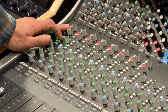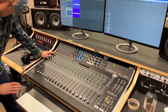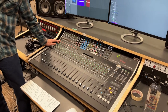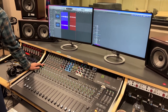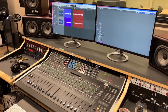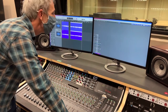It's a little buzzy but I think that's just single coils on that bass, so it's fine. In this instance there's no way of moving the microphone closer because the technology is always going to lag some, so a phase shift is the way to fix it — it's the only way. The DI is just faster. We can't move the mic; it would make it worse. The round trip from the DI to the amp, out the speaker, to the mic takes longer.